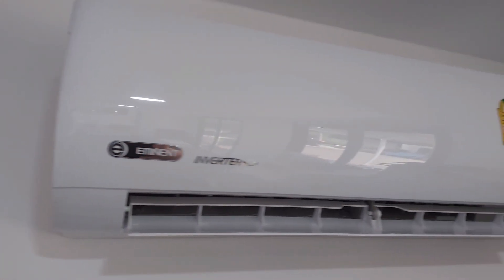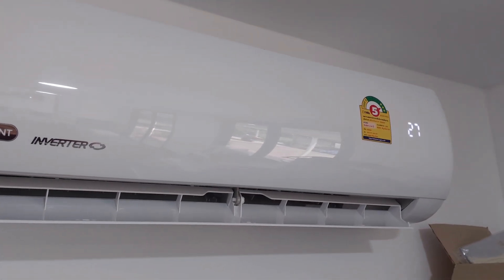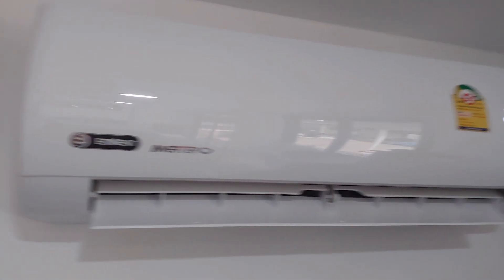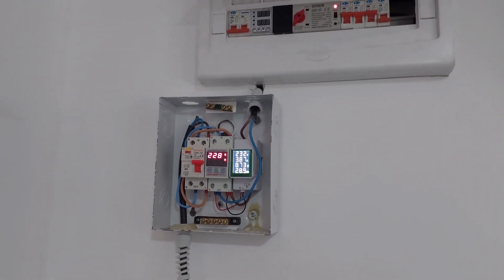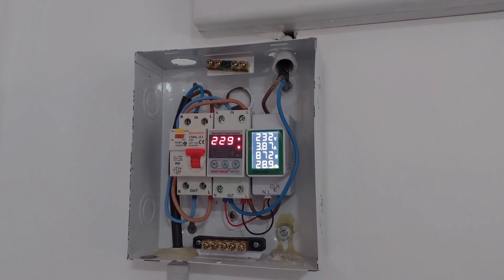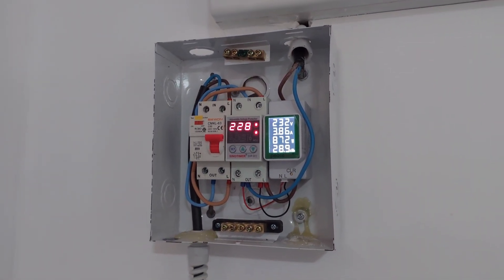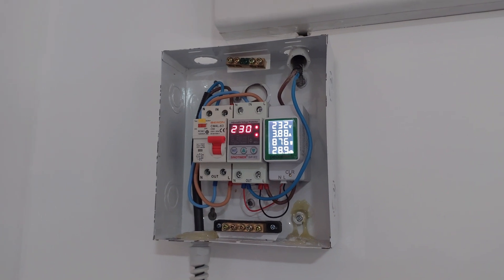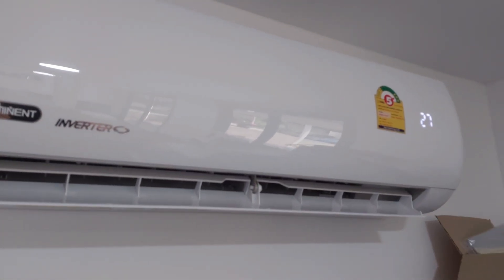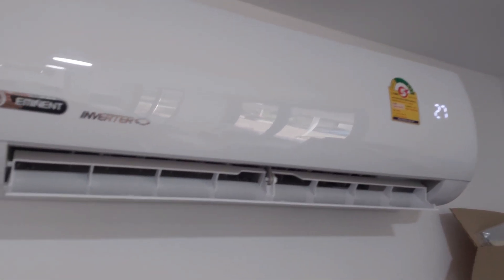It's been running the air conditioning through the transfer switch at a nice cool 27 degrees. I still need to put the panel cover on, but I just want to show you the wiring for the meter and the overvoltage protector. The AC 200 is putting out a steady 230 volts. I'm running it through this cable into the transfer switch, and the main panel with the grid is off — running air conditioning at 27, nice and cool.